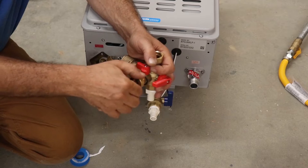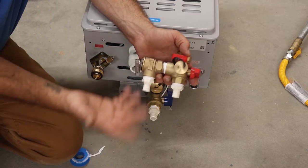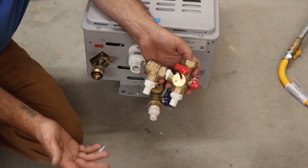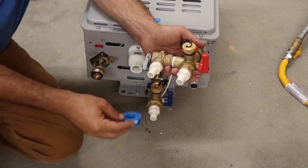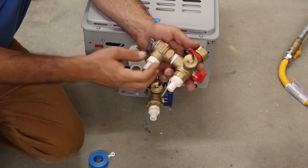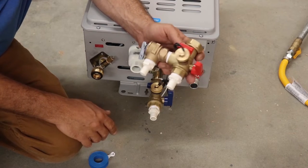The reason for these is that this is how you flush your tankless water heater out — what they call descaling — through these little service ports on the front. You'll want adapters to switch over to whatever plumbing pipe material you're using. We use PEX a lot, so these are three-quarter threaded PEX adapters. Use Teflon tape on your fresh water connections, not pipe dope — that thread sealer can get caught in aerators and filters and cause big problems.